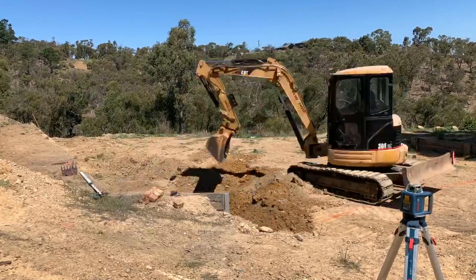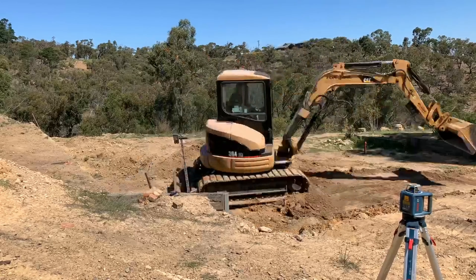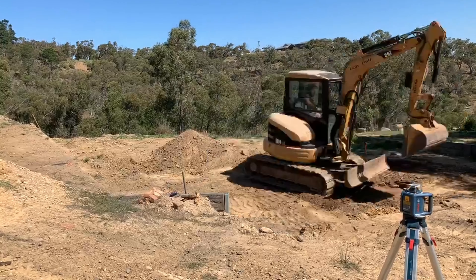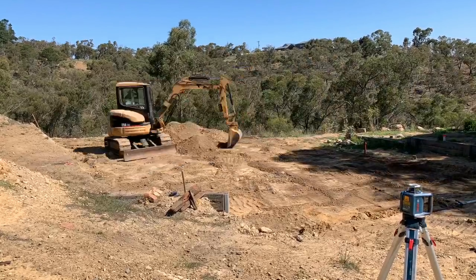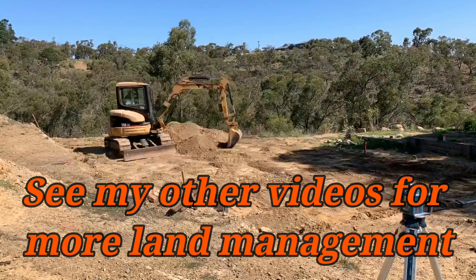You can see here I'm working through with the mud bucket on the excavator, doing a real final surface scrape and getting all these areas level within about 5–10 millimetres. Once that was done it was time to set out the area for the piles, but you'll see that in a future video. Hopefully you enjoyed this — thanks for watching and stay tuned for the next one.